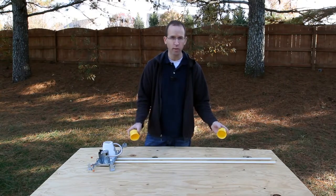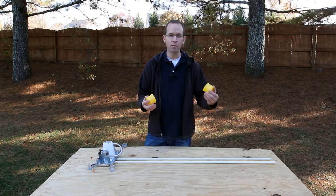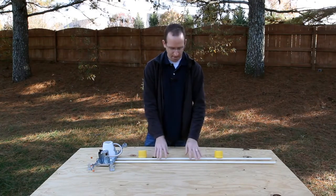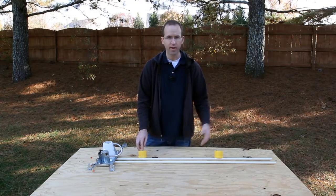So we've got special switches that don't terminate the power — these are three-way switches. They instead alternate between two hots. And we've got special wire, 14-3, that has two hots in it, so that we can have this scenario. See you in the next video.